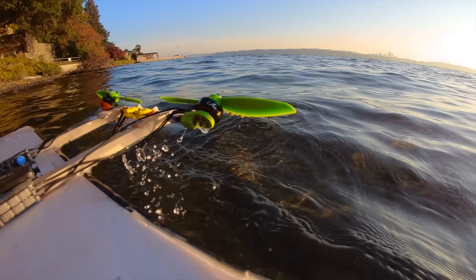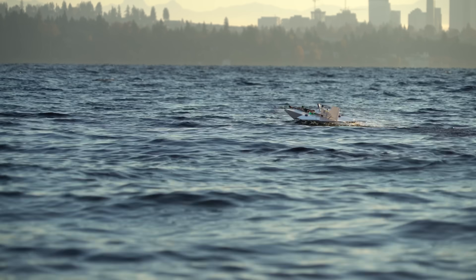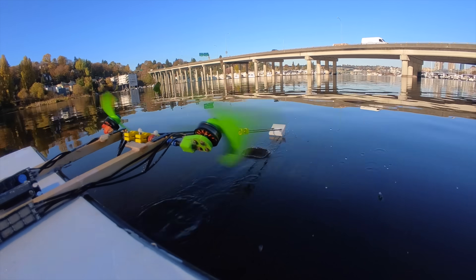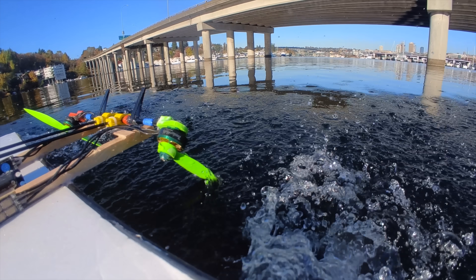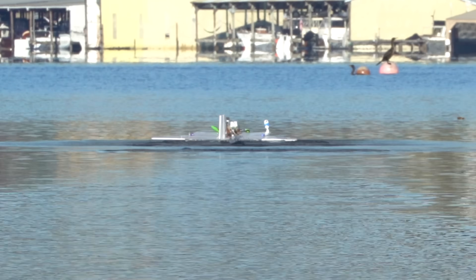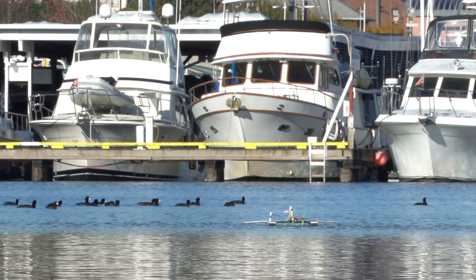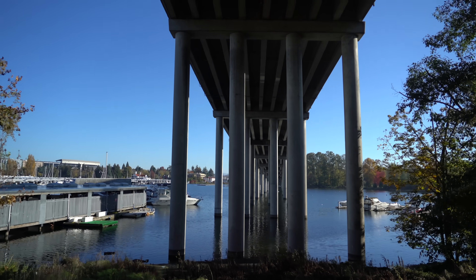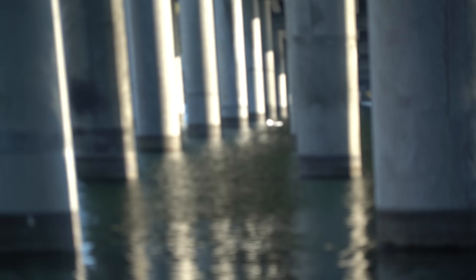To do this, I attached two carbon rods to the motor pivot tube and put a little water ski on the front. The first time I tested this, the waves were too large and it did not work well at all — then the motor pivot got stuck. After that, I brought it out on a calmer day, and the water ski was creating too much aerodynamic lift and it flew up. I added a hard stop to prevent it from rotating down too far, but not one for preventing it from rotating up. There was a slight breeze moving it across the lake, so I was hoping it would get blown all the way to the adjacent shore.